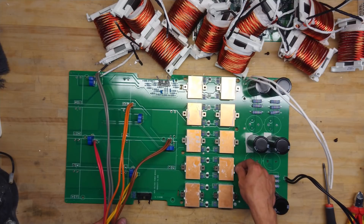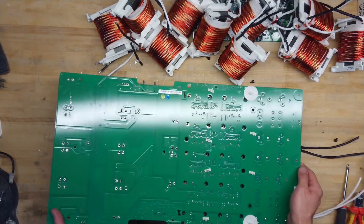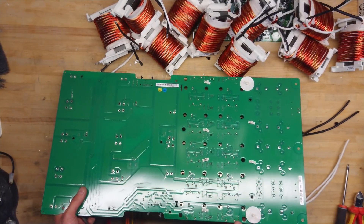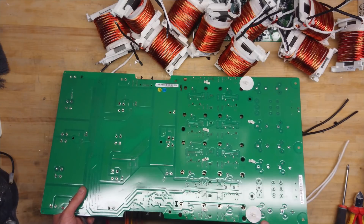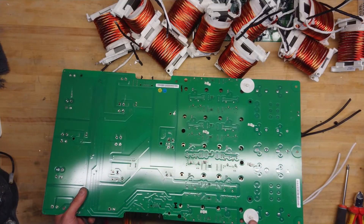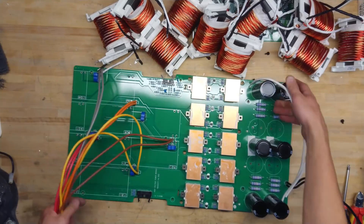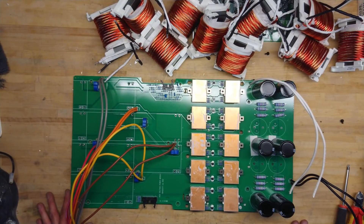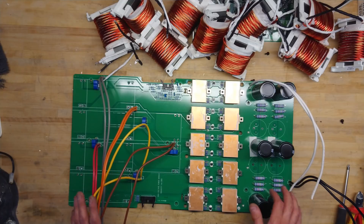The smaller IGBT modules will be a little more difficult to reuse, as they are soldered in by a good 20 pins per module, making it almost impossible to desolder easily without damaging the module itself. Other than that, this is a pretty huge board with a good layout. Very interesting to take apart, but unfortunately very hard to reuse the IGBTs from these newer units — that's what we see with new technology: it gets smaller, more integrated, and harder for amateurs to reuse.